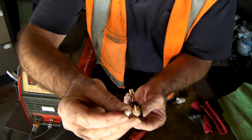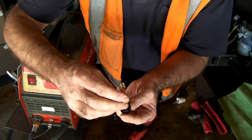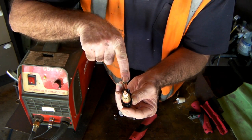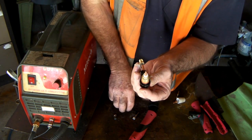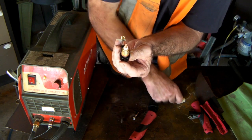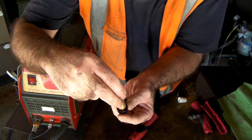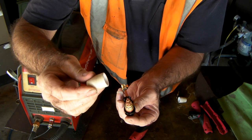This has got a swirl ring, and if you look at it you can see it's got little holes in it. The compressed air comes up there, goes up here, and comes out of these holes. Then you put a cap on — which is your cutting nozzle — and the whole thing is screwed together with one of these, which is your shield.